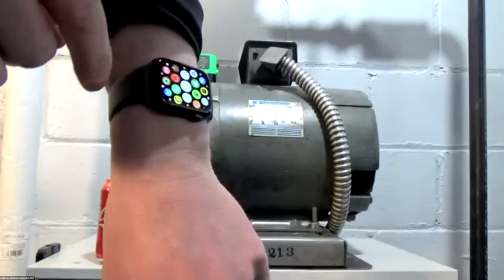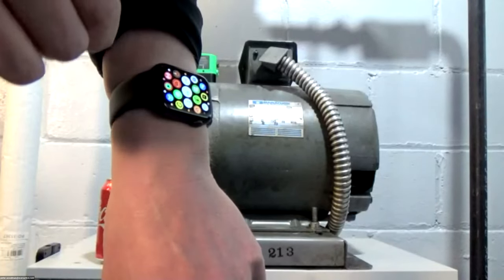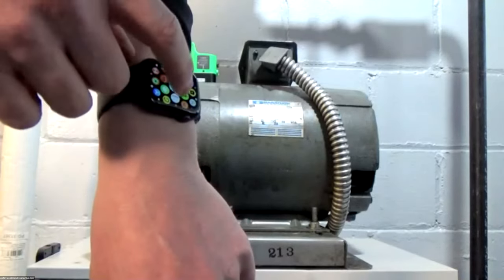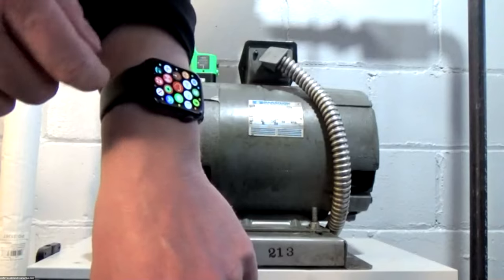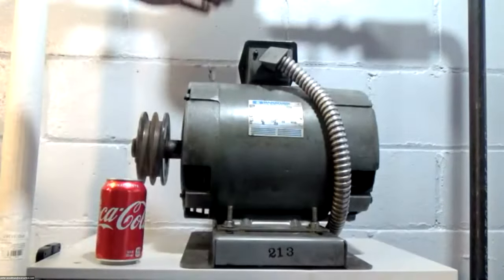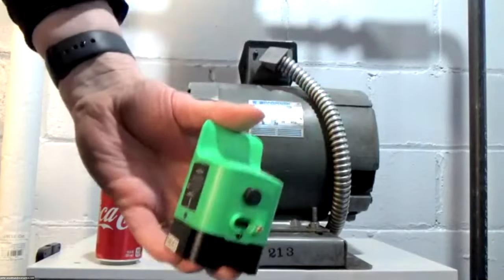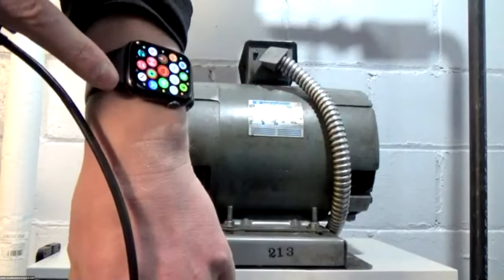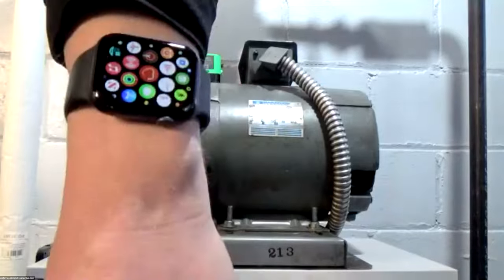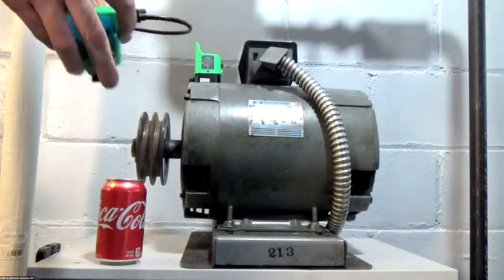The lowest of those four is Bluetooth low energy. It has a power budget of about 50 microwatts. The way it gets away with that is it duty cycles itself off about 99% of the time, firing on in little blips each second to talk to my phone or my laptop. Our Evernet radio that's always on and always listening inside this sensor runs at 200 nanowatts, 1,000 times lower than BLE. So if you tried to use a little harvester like this to power the watch, it wouldn't even boot. It's far more power hungry than this little sensor.